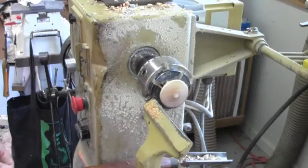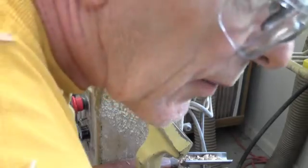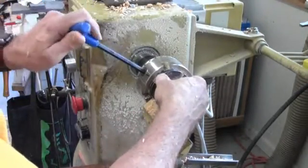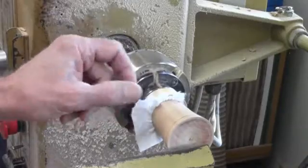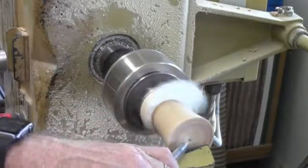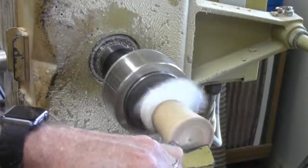You know, make a jam chuck and clean up the top. I would normally have enough wood left right here, but I had to shorten it, if you remember. And so I will grab another piece of wood. Okay, so I created a jam chuck and it was a little loose, so I put a piece of tissue behind the wood to firm it up on the jam chuck. And I'm just going to take my spindle gouge now and clean up the bottom.